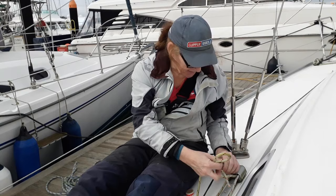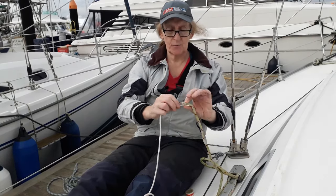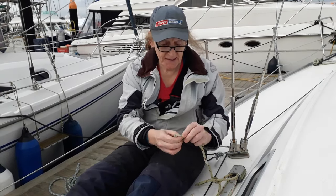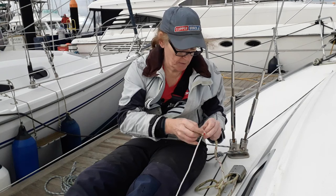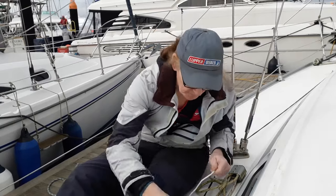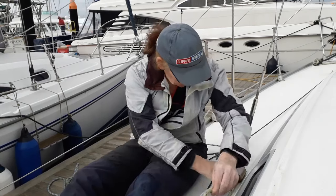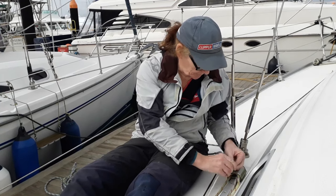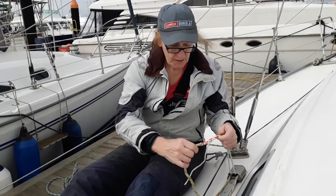I'm going to take my mousing lines and tie them to the bowline. They've got to go around these fittings, so you can't joint them straight — they won't fit. You've got to joint them like this and let the tape do it nice and gently, otherwise it just doesn't go through. I've got some nice thin whipping tape — just put that and keep going. It doesn't have to be a perfect joint; you just have to make sure this does not come off before you're ready. And it's through — we're good, that one's done.